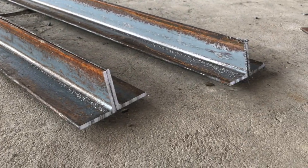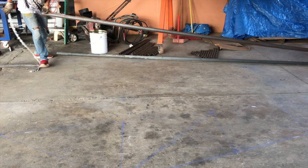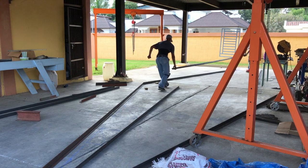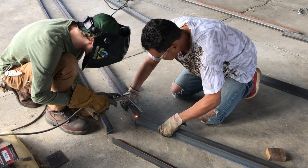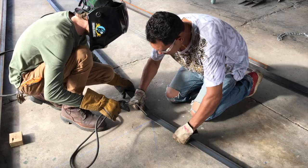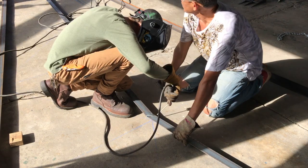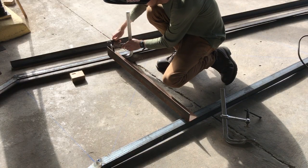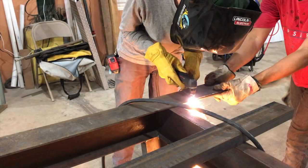Here you can see the quality of the cuts. We're laying out all of the angle iron with the chalk line marks on the ground where they're butted together, and we'll be tack welding them with E6013. One very important thing is to maintain that the trusses are parallel to each other at the correct distances so things don't warp. That's achieved by clamping a piece of angle iron — I use a hefty three-inch by quarter-inch angle iron — down really well.